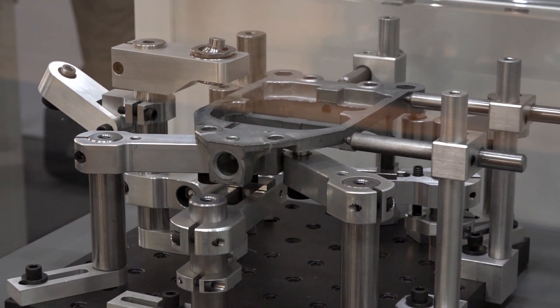And what type of engineering companies would you be aiming this product at — is it subcontractors, is it OEMs? We're talking to many aerospace customers, but even subcontractors looking to set a part up quickly. There's quite a large product range within the Blue Photon kit — you can have a grid plate, position the grippers in various positions, stops, a flexible clamping system for a tool room. It could be aero engine parts or even airframe parts. Using the SNAP methodology, rather than wasting a lot of aluminium around the part used for clamping, you can get much closer to the profile of the part with the material.